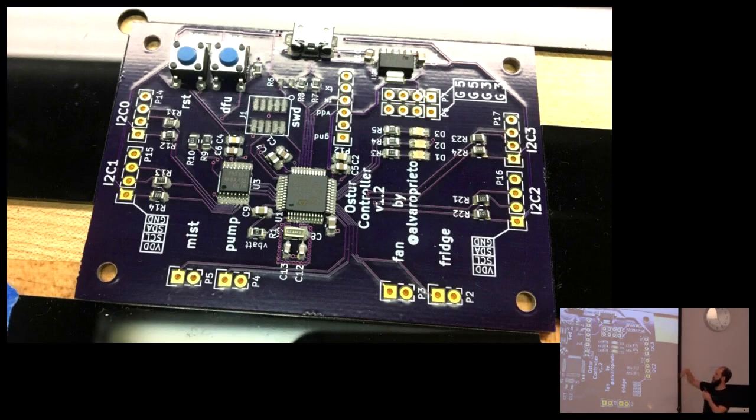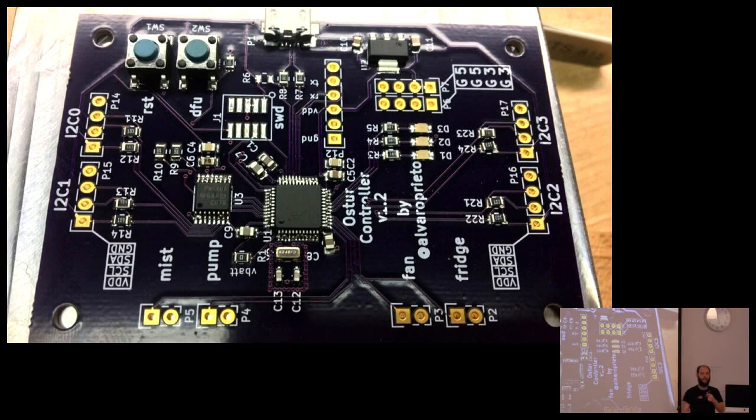So I learned how to do a paste, and it's so much easier to just put the solder paste and put all the components down and then heat it up. I got one of those lab beaker heaters on eBay. It's like a ceramic top, and it's super easy. A lot of people get just like a skillet or something, but for my boards, they're all small enough that I was able to just do that.